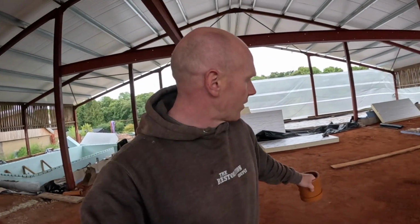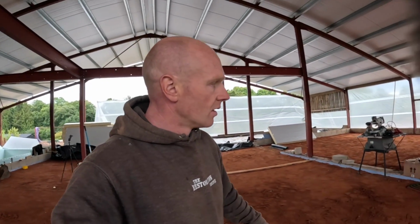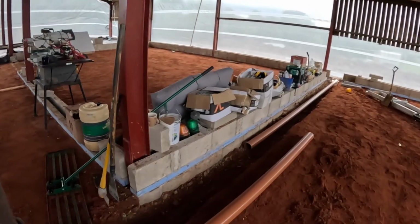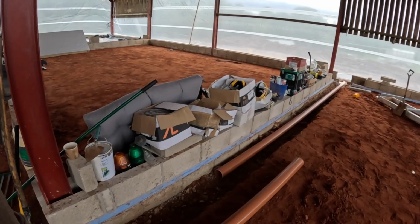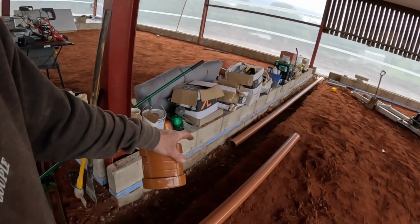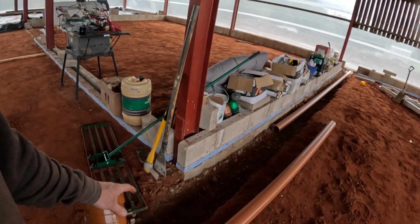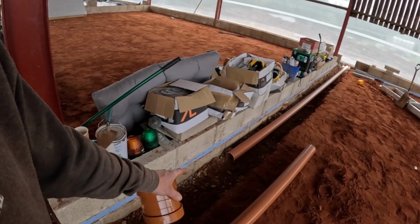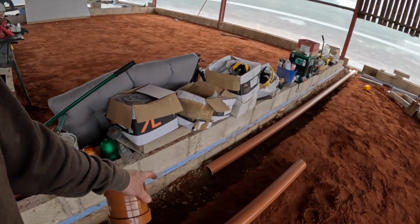Then the other update, which I didn't mention, is although we started getting our sand blinding down, we've made a bit of an error and forgot another trench. So fortunately, Dad to the rescue on Saturday, did a good graft and got this dug out by hand, even though we'd rolled and compacted it, so it was so solid. But this is not for waste water, it's actually for our fresh air inlet for our wood burner.